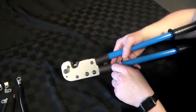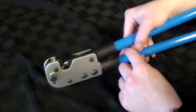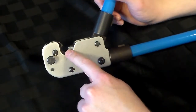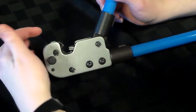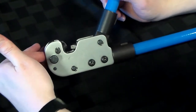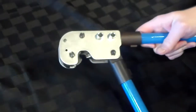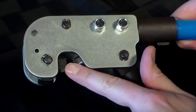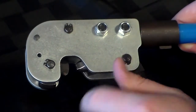As we zoom in, you will notice the handle operates the crimping plate in a fluid back and forth movement. The next thing you'll notice is the wire gauge wheel selector. This is secured firmly in place with a thumb screw knob. To select the appropriate gauge, simply turn the screw knob counterclockwise to loosen it, and that will release the wheel selector. Each crimping slot is numbered to show the corresponding wire gauge listed in square millimeters, as you see here.